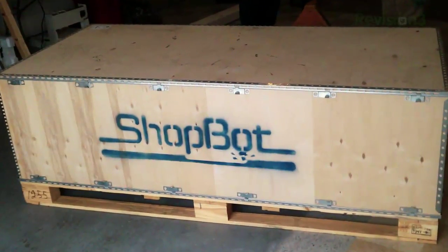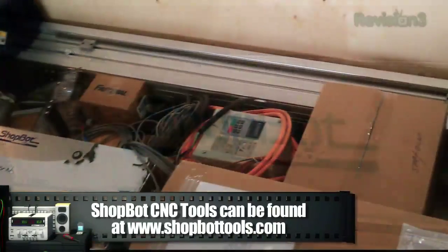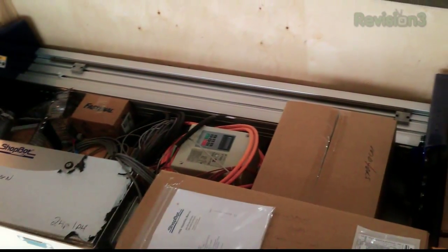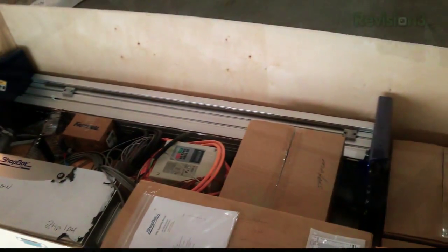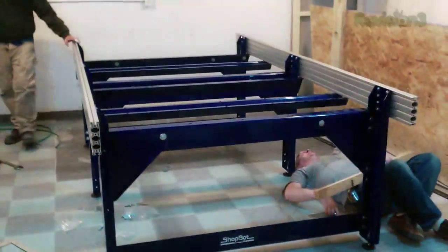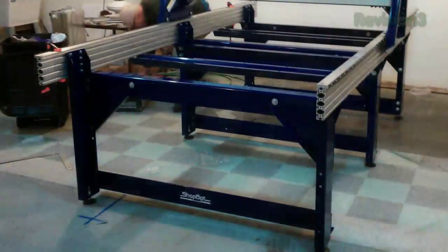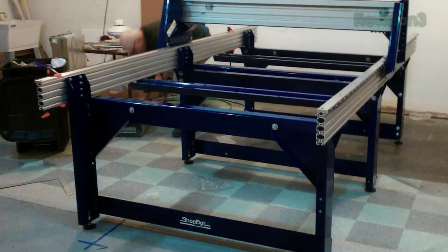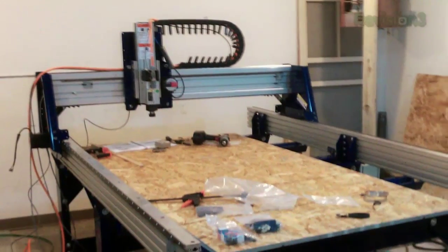Here's the shop-bought CNC machine I ordered. It comes in a crate — some assembly required. Most of the parts are either structural or electronic in nature. As we discussed in episode 2, a CNC machine is fairly simple; it's the software to run it that's complicated. Some assemblies come pre-built, such as this Y-axis arm. Most of the construction time involves putting the table together and keeping it square. The Y-axis arm is a fixed size with rollers on the end, so we've got to make sure the sides of our table are parallel. Three layers of material are used to create the work table.